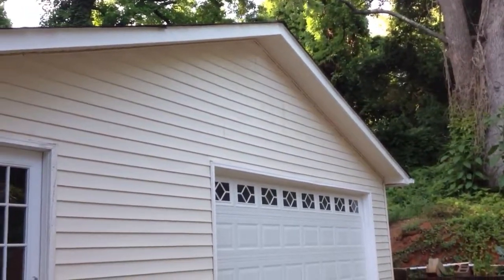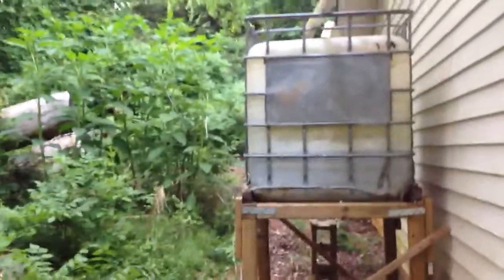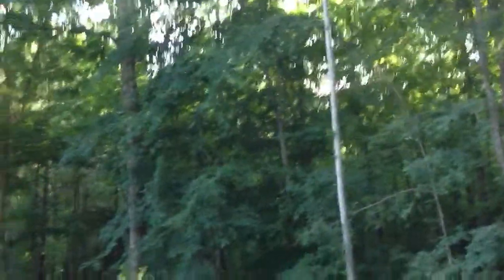Here our garage collects on two different gutters on opposite ends, and in the back of our garage we have our water tank. We tried to make this the cheapest system we could find and we found a water tank already behind this property, so we adapted it and patched it up. Even if the valve on it doesn't work well, we went ahead and used it — it's for now sealed open — and it sends the water out to the side of the garage. You can see the gutters collect into the top of this tote, which I believe is a 275 gallon, so more than we need. With about three inches of rain it will fill up a good foot. So that is our square foot garden and drip water rain collection system.